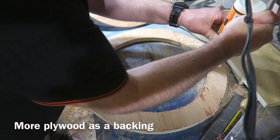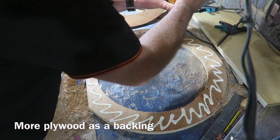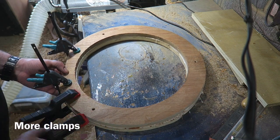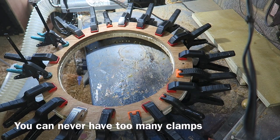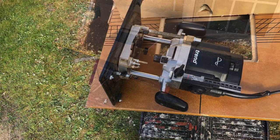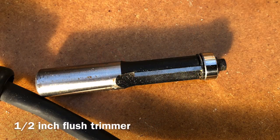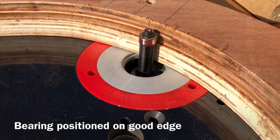I've rough cut two other pieces because I've run out of big pieces of plywood, so I'm using off cuts. I've got two pieces that are rough cut to form a lamination — plenty of glue and plenty of clamps. You can never have too many clamps. The gluing up actually held me up quite a lot with this project. The next day I got my homemade router table out using my bigger T11 router mounted in a router plate table insert with a half-inch flush trim bit, and I'm trimming up the rough lamination to match the good lamination.